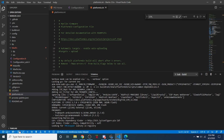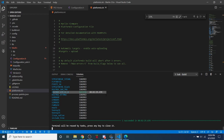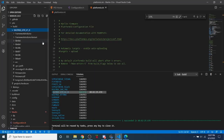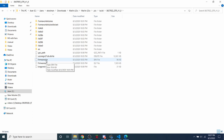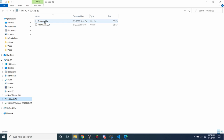The compilation completed successfully in 2 minutes and 29 seconds (this may vary by computer). Now copy the output: go to the .pio folder > build > gtr folder, right-click, Reveal in Explorer, open the gtr folder, find the finished binary file, right-click > Send To the SD card. Confirm it's there, then remove the SD card from the computer to install it in the GTR.